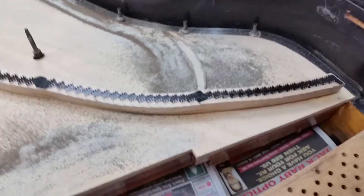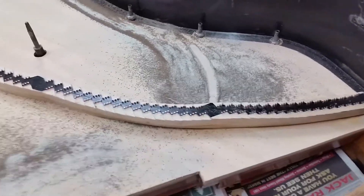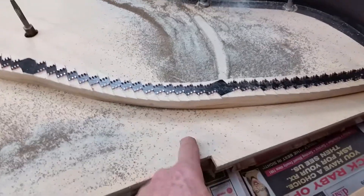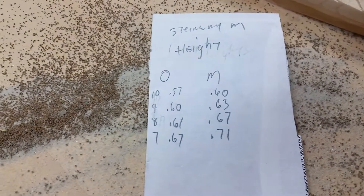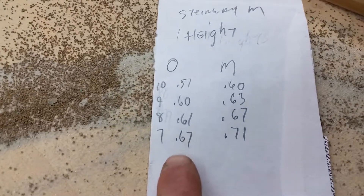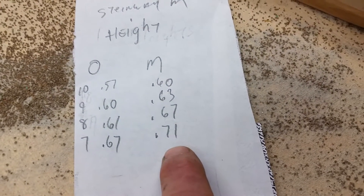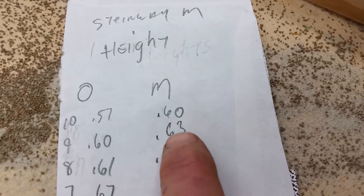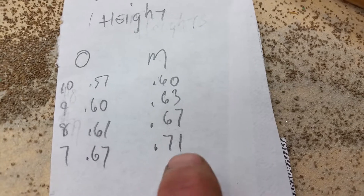How I did that was — the only difference I made is I made the panel a little thicker. The Steinway original board was about a quarter inch up here, and I'm here at about five-sixteenths. I also made the ribs a little taller. Here are the originals right here — the height of these top four ribs — and here's the new one. You can see I added a little bit, I didn't go crazy, just to make them a little beefier.